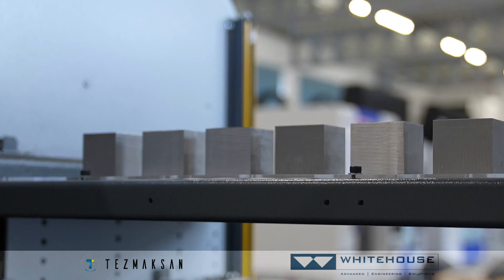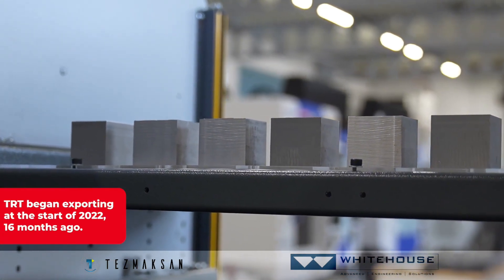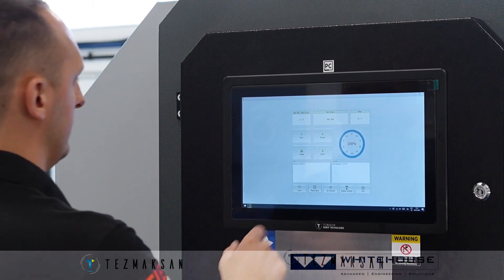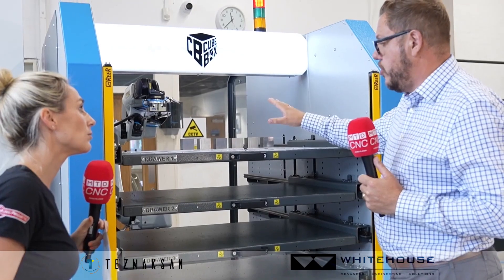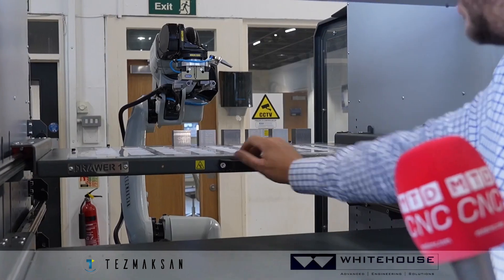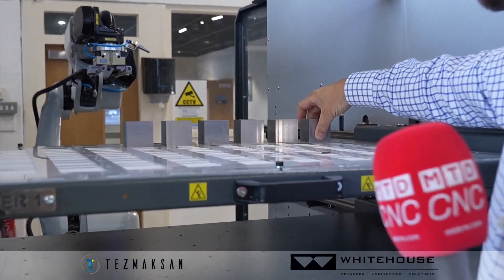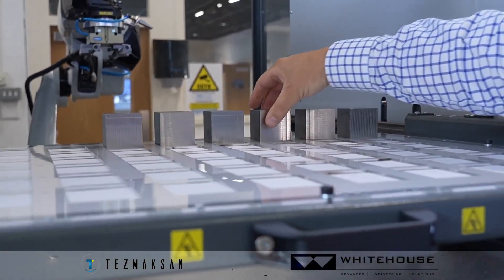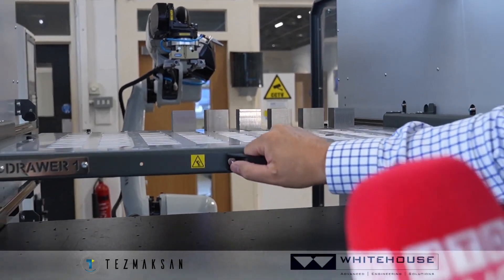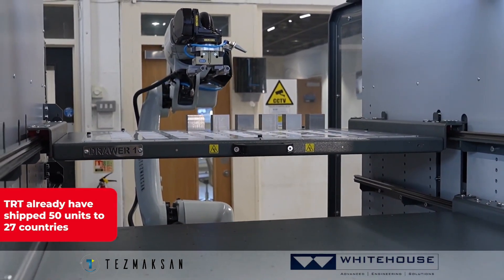From a billet loading point of view, it's a template system the customer uses across the five drawers. You simply load the billet to the front and right-hand side of the slot in each template. That template is worked out by a CAD/CAM system, and importantly there's no teaching required — a DXF is loaded into the controller and the robot knows each pickup point. We pull the tray out, load the billets, tell the system which positions are loaded or load the whole pallet, then slide it back into position.